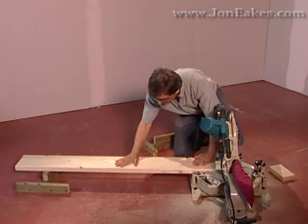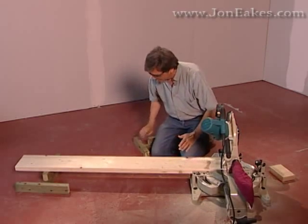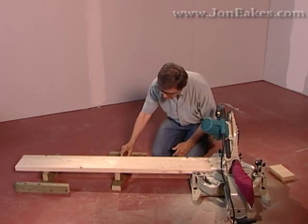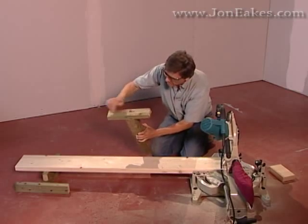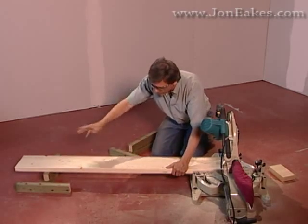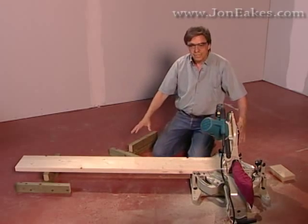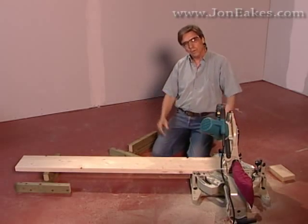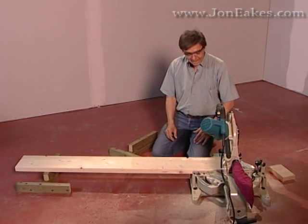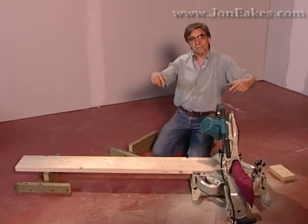A big board like that would have been a mess if it fell down. All you need is some sort of scrap wood support that's the right height for your saw. The reason for the T on the end is that when you slide this way, it doesn't tip over or fall out. It's quick and dirty, it's on the floor, but that's often where we're working when moving around the construction site.